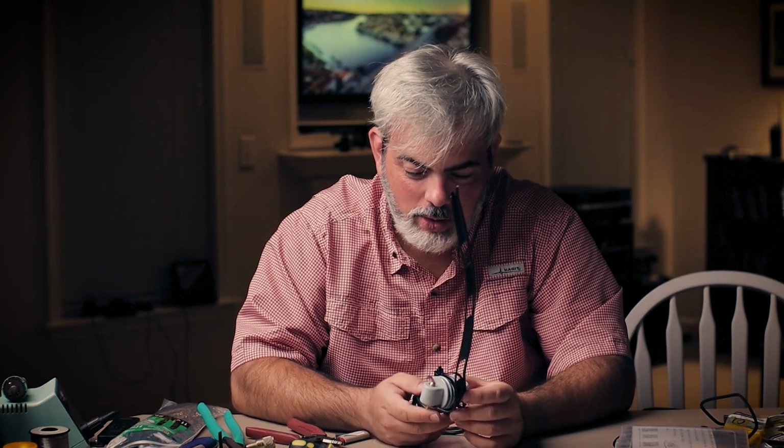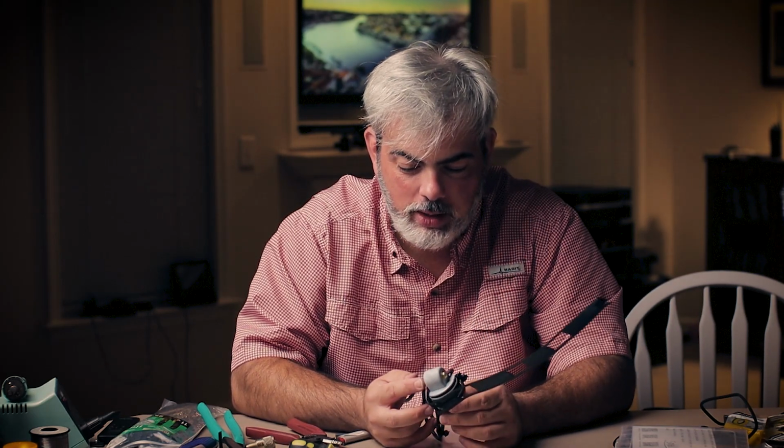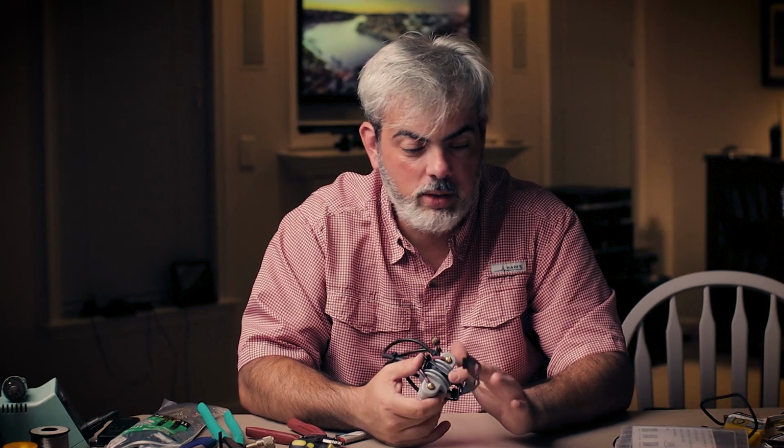So now you got your antenna going up the tree there. You got your coax coming down with your choke. And that's how you do it. It's really actually simple. I think we made it probably more complicated than it needs to be. But just the right connectors, the brass screws. Remember we talked about why to use brass? Because even when it corrodes, it will still conduct, and they won't gall like stainless. And generally, even after they do start to corrode, you can get them loose again. So it's real good. It doesn't cost all that much.